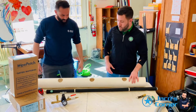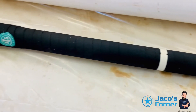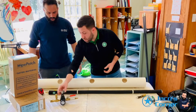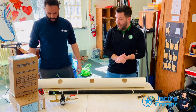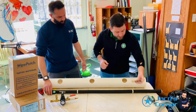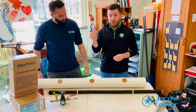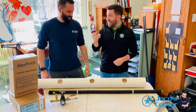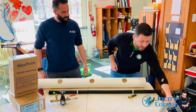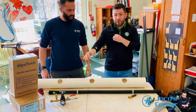Let's talk a little bit about the Source 1 equipment for pipe patching. Here we have a 3-4 packer — this will install 3 or 4 inch pipe patch kits. Next, let's talk about our regulator — this will regulate air into your Source 1 packer so you can inflate it to the proper PSI when you're patching your pipe. This is a flex adapter — it goes on the end of your packer and is very useful for going around 45s, 90s, any kind of bends. And this is your push rod — it will push your packer into place and also inflate your packer as well.